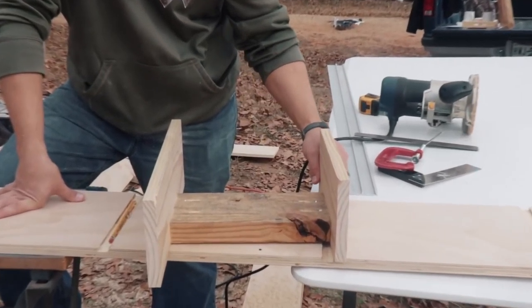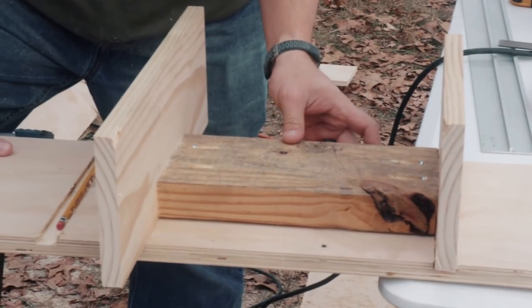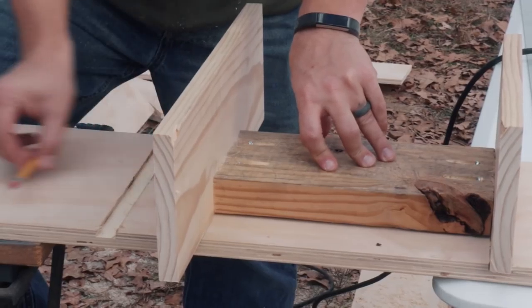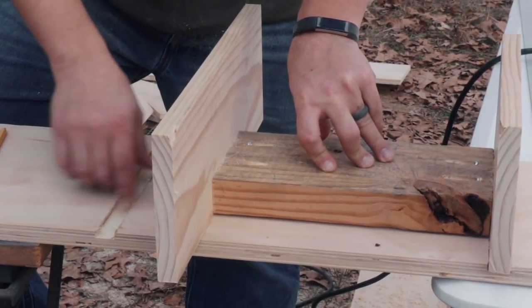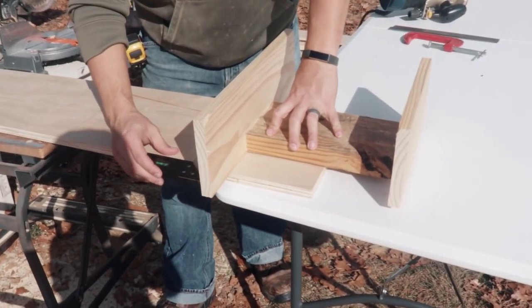So this time I was determined to put slots in the sides just to make the whole assembly process much smoother. I built a jig — that you'll see on the screen — that allowed me to run the router down the width of the shelf side, which kept the spacing even and kept them square with the edges.